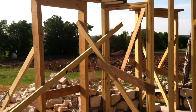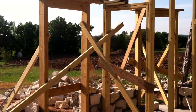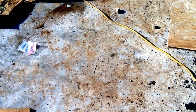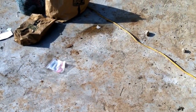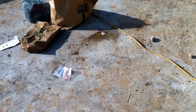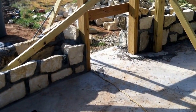Hello everyone, this is Emery. I just wanted to go over what's happened out here since the last video. First off, we put the floor in. The floor is concrete — it was a big pour. We framed it, put in the outside bottom layer of rock on top of the footer foundation and the French drain, which allowed me to pour the concrete in between. At the doors, I just put a board there and buttressed them up, then poured the concrete.